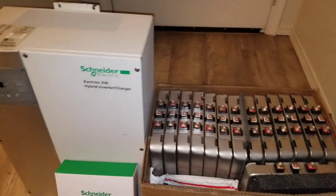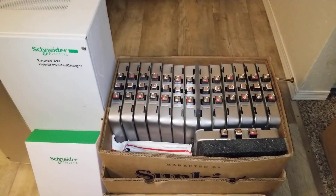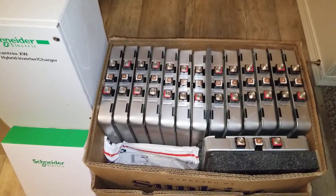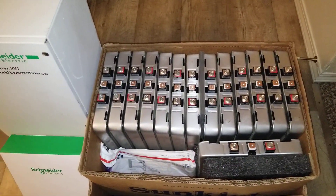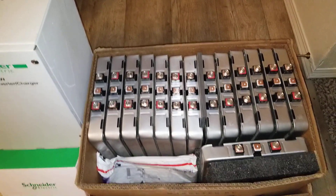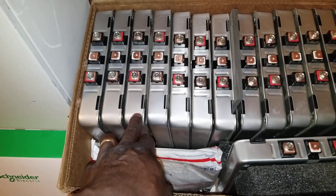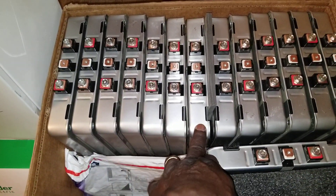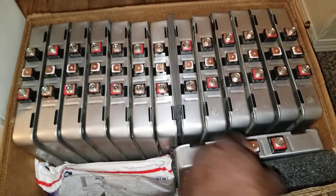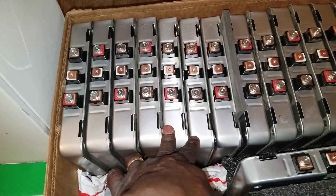You can see the lithium batteries here — Nissan Leaf lithium batteries, which is a seven kilowatt system. This system is going to be wired in two strings of sevens, which gives it a total of 14. From here, one through seven is one string, and one through seven is the second string — they've already lined them up the way they should.